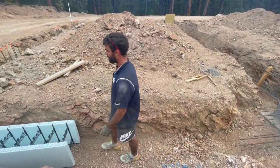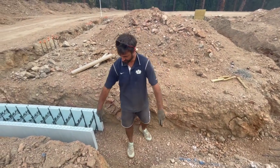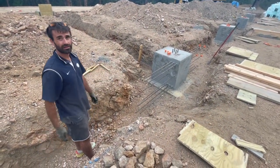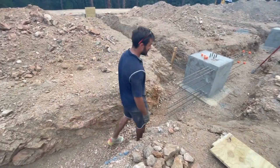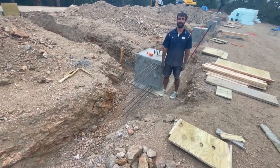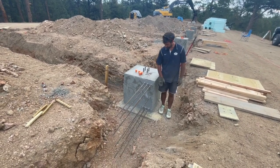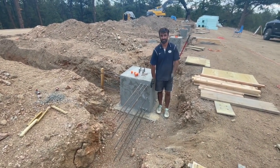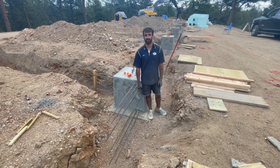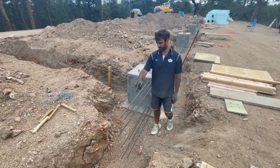We'll put another eight footer there and in the middle, but then we'd have two joints. The joint will probably be on the back of this - we'll run the concrete. The styrofoam is gonna run on the outside of this too, so this is also insulated. Is the wall going to the side of this concrete? The outside of the concrete lines up the outside of the pilaster, so the styrofoam will stick out of here. Should I just move this over and see where the bolt is? Because really we're wasting time not doing the concrete.